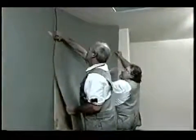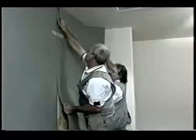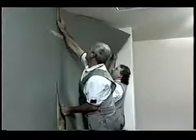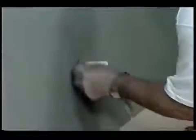Once the adhesive is spread and set, you're ready to install the piece. Hold the second piece up and align the reference marks as tightly as possible. When done correctly, the two pieces should line up perfectly at the reference marks, and the seam will virtually disappear. Repeat the wall roller procedure on each piece. Along the seams, use a seam roller. This will force the glue into the backing and evenly spread the adhesive, giving proper transfer of the adhesive.